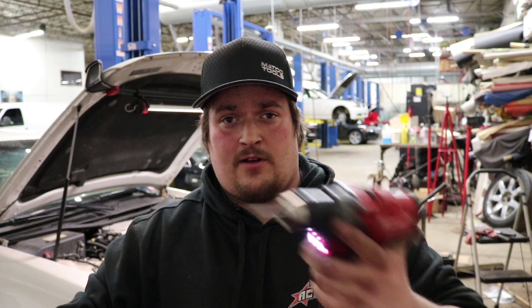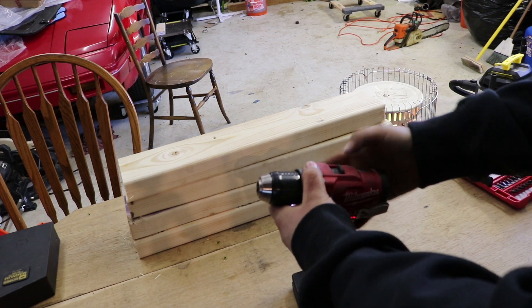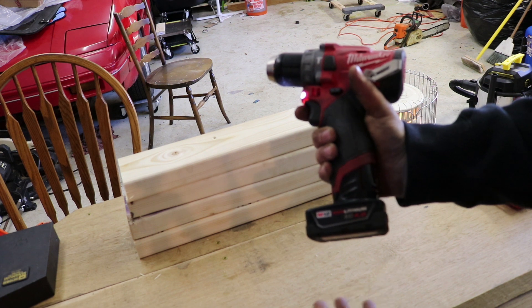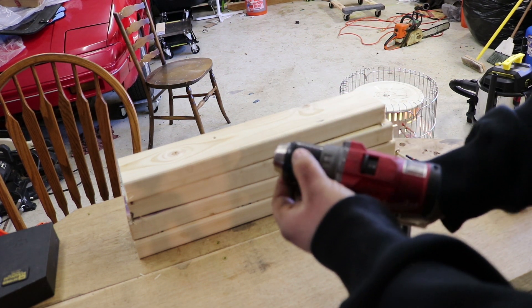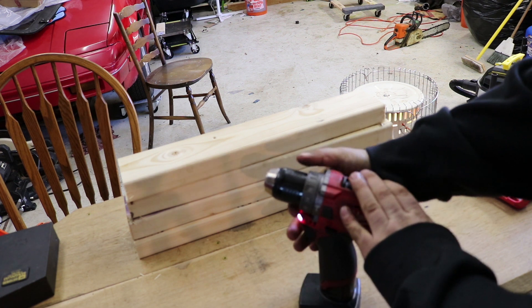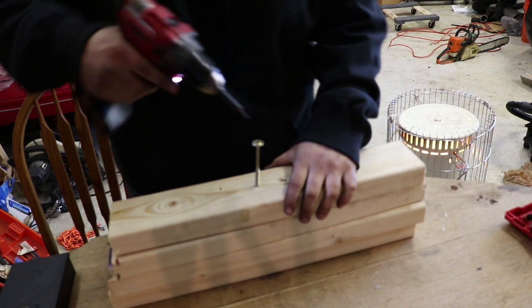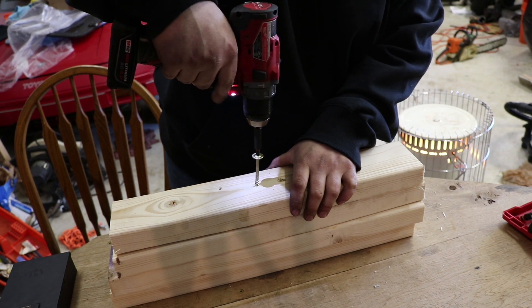It's nice and tight and gets through what I need. It works great as a drill, and the hammer drill option is just a simple click. Two speed settings, battery fuel gauge, accepts the whole line of M12 batteries including the XC 6.0 — we're testing with the 4.0 today. Quick reverse, bright LED light, all-metal chuck — no plastic. The electronic clutch in drill mode just clicks and stops automatically when it senses the right torque.